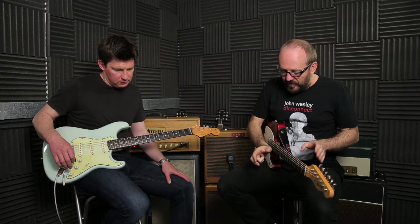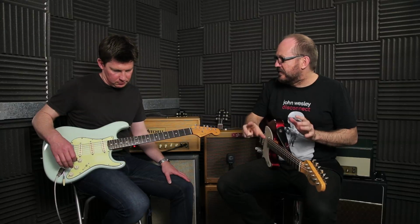Chimier. Yeah. Cleaner. Exactly. Brighter. And you'll find more dynamic, because the input isn't compressing the same way it would be with your full guitar level. So this is about gain structure. The reason that we designed these amplifiers in G2 is that sometimes you've got a pedal that just needs a little bit more love at the input.